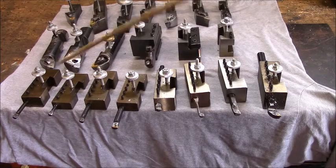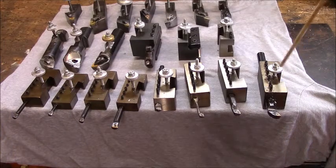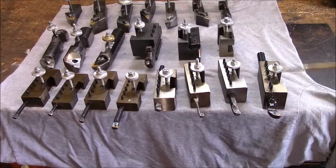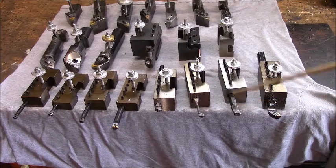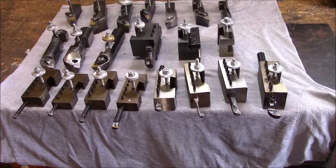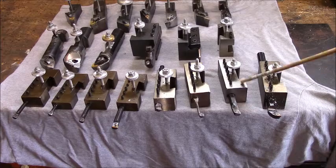And what I did when I machined these is basically I tucked the block, squared it up, cut the dovetail to fit, and then I sliced these up, sort of like, I would say, bologna. The reasoning for the different thicknesses is how I got all these tools out of 1 piece of steel, quite honestly. The thicker the block, the bigger the boring bar.